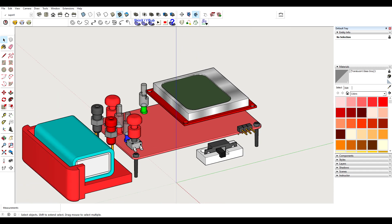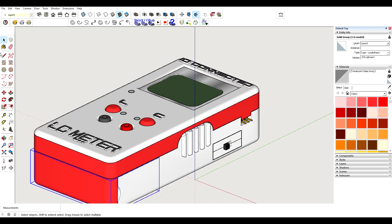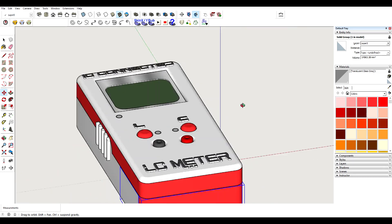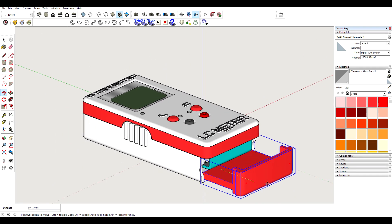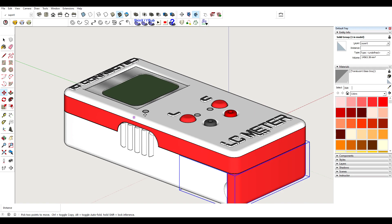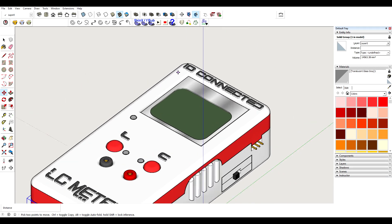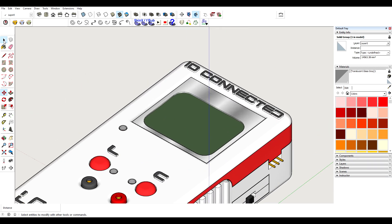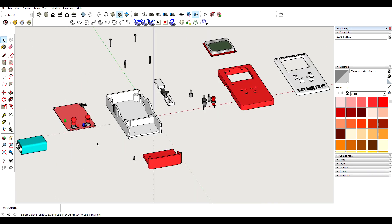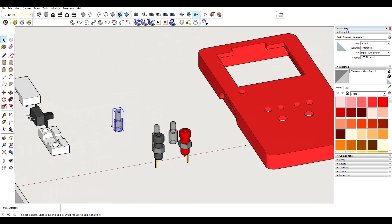For example, when I have parts which need to have cutouts or holes, I'm drawing the actual parts too, and it helps a lot with the modeling process. It makes it easier not only to visualize the whole thing but also to center and choose the right dimensions and proportions for the parts which will be 3D printed. I'm using PLA to print all the parts in three different colors: white, red, and a translucent transparent filament.